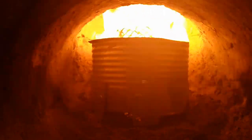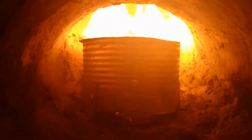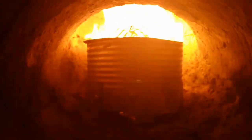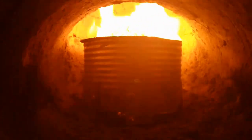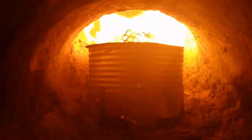I've made these as big as a 50-gallon drum with a chimney on top, and they get pretty good heat. A 50-gallon drum will burn about 12 hours with about a two-inch hole, and if you put about a two-foot chimney on top it really gets a good draw. Anyway, I want to give you guys an update — I'm fairly happy with it.